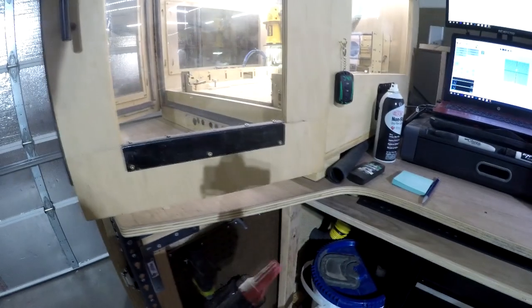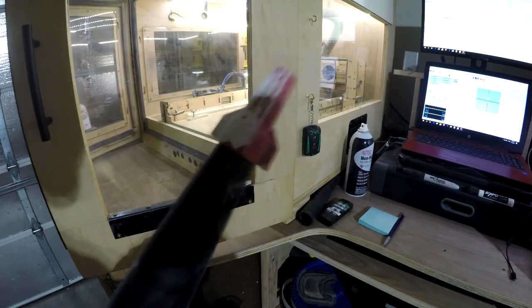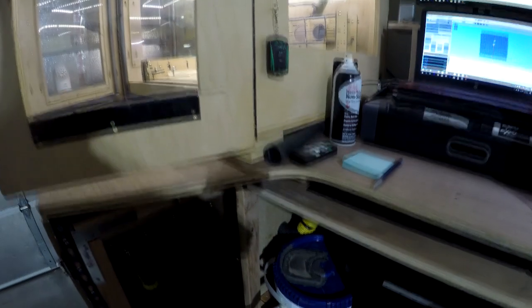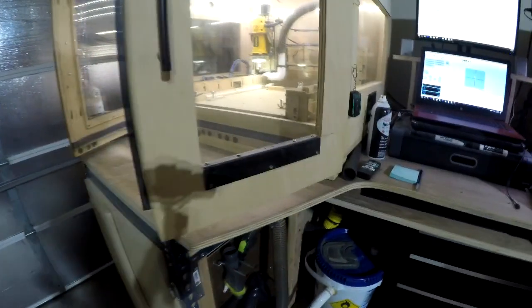This is a second feed, and I'm using a little electrical twist on cap to basically kill the vacuum. This vacuum setup is always on, so that's how this is basically stopping it. And when I pull this off, I gain suction back. It's a pretty quick fix. And then the back canister, I have it split off into two T's. So you have the feed line, and then you have the left CNC and right CNC.